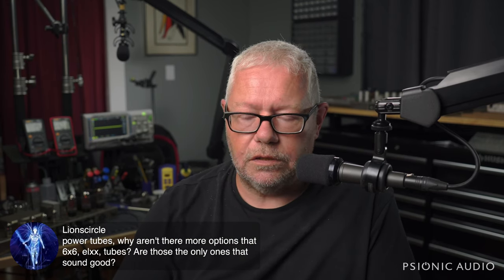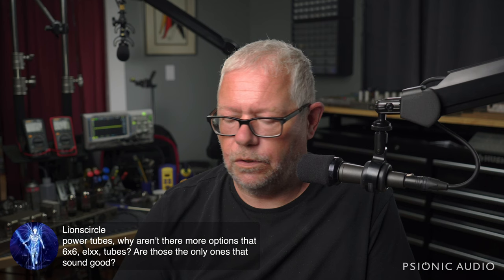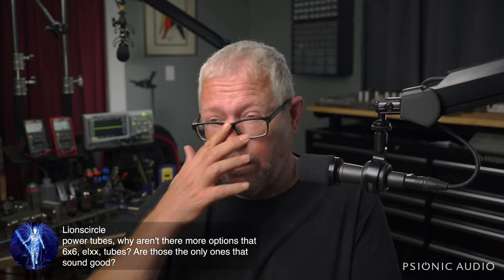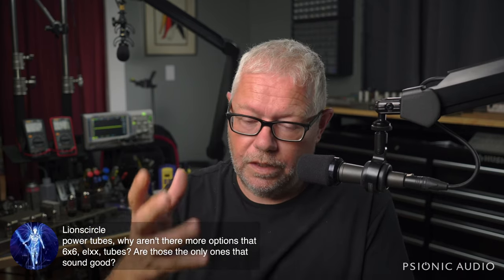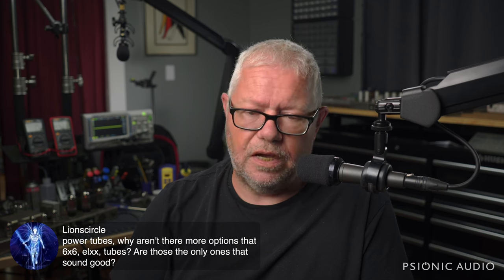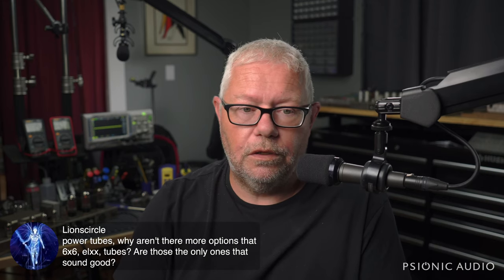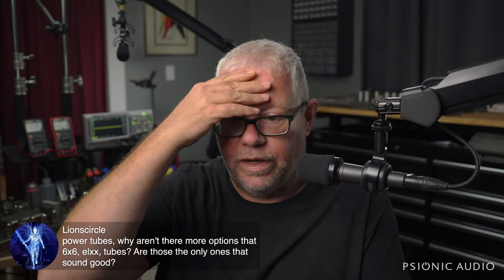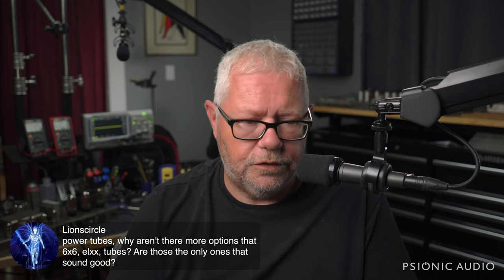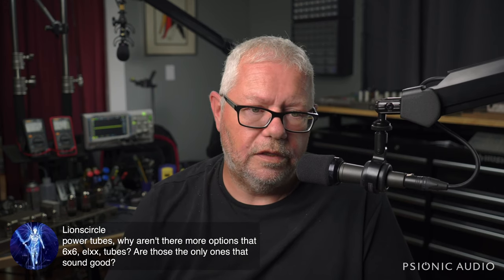So all of a sudden, within the musical industry, it's like, okay, we're going to work around interchangeable tube types. So I could put KT66s in this, I could put EL34s in this, I could put 6550s in this. There are things you have to bear in mind when you make those changes, but you don't have to use different sockets for them. There's no wild variation between the design for 6L6s versus the design for 6550s. Nothing's weird. There's nothing like, oh, I can't remember, we've got to find that one guy who knows how to use this. So that's why we're pretty much down to the usual couple dozen suspects. And now today, the only ones that are still being made are the ones that we use.